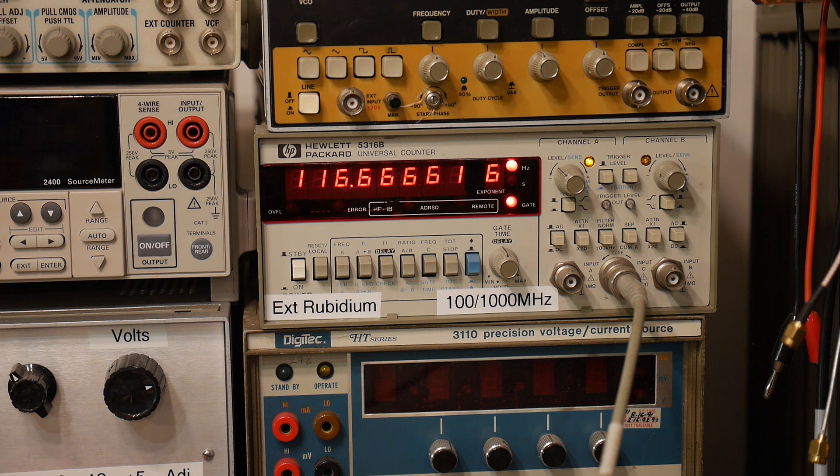Let's put it back to 100 megahertz. You can see that's pretty accurate. Supposedly it has a temperature-controlled oscillator — I don't think it's one you can adjust; I think it's fixed. So this is probably within tolerance of their fixed frequency. Certainly good to about 0.01 to 0.005 percent — not too bad at all.